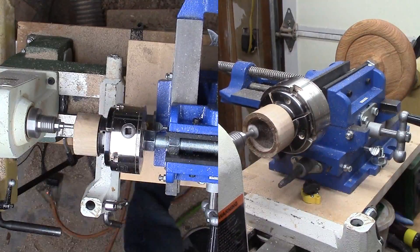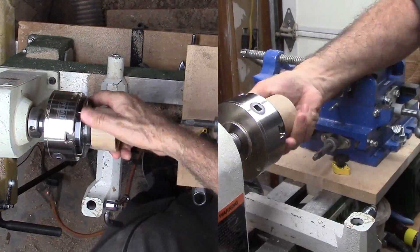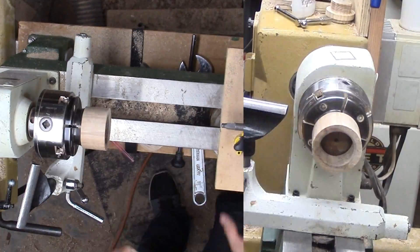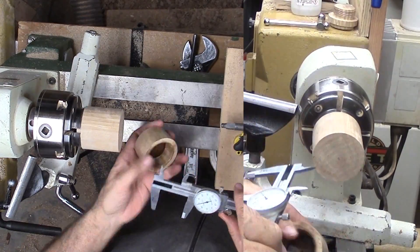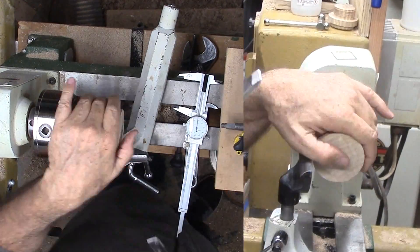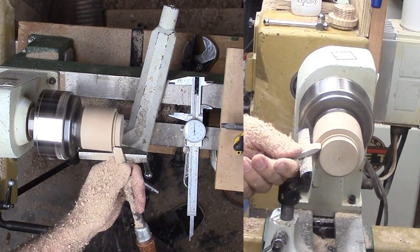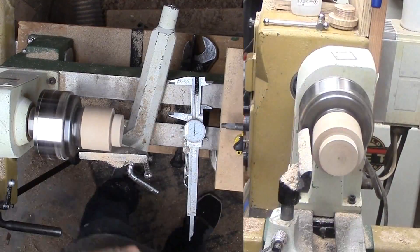The top is almost done but I have to do some cleanup. Since the mini lathe is mounted onto my big lathe, I'm having to disassemble the cutter from the spindle so I can use the lathe. The cleanup on the top amounts to cutting a chamfer to help threads start to engage easier, a little cleanup on the lip, and a light sanding of the threads to ease the sharp point. Then I'm applying my beeswax and mineral oil mix for lubrication. Now for the base part — I need to cut a tenon to fit the threads on the top. I need to get a little too large; the cutter will take care of cutting it down to size. Then cut a shallow valley that the cutter can end in, reassemble the cutter, move the jig into approximate position, and lock down the banjo.